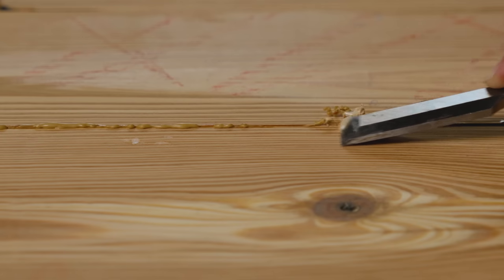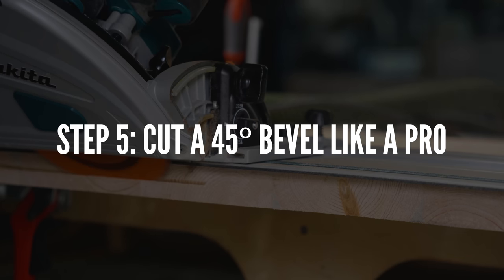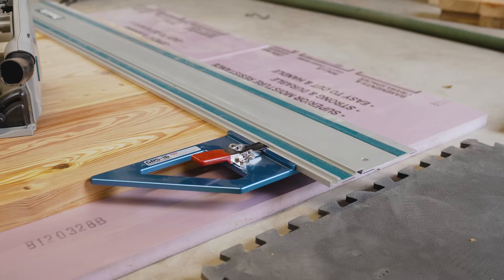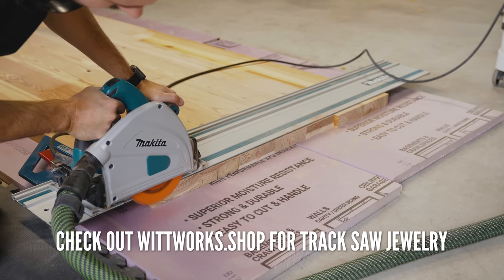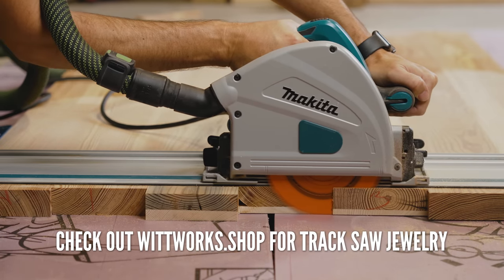At this point it was time to clean the glue squeeze-out. I used a combination of a Harbor Freight chisel, a card scraper, and my $575 Festool sander. Has a Harbor Freight chisel and Festool sander ever worked so closely together? I think not. Step five: cut a 45-degree bevel without hurting myself. This is one of my favorite parts of the project when I get my beloved track saw out to square off the ends. One of the things I really love about having a track saw is these TSO guide rail squares — TSO is a partner to my channel, but I paid for this long before they knew who I was. It turns your track into a precision square. I don't even mark or measure most of the time; I just line things up and get a perfect 90-degree cut every time. Now here's a sad story.